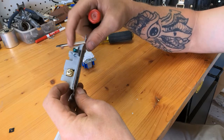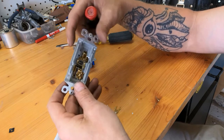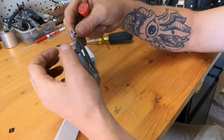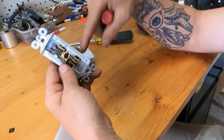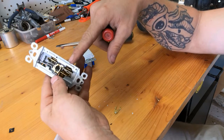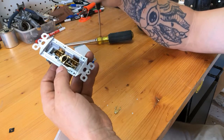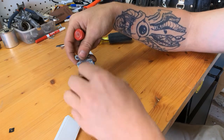Your travelers are hooked up here in between each of these. And then the ground screw - you can't forget that - the ground screw is just a piece of metal that's touching this whole yoke. So you're supposed to ground every one of these devices, just in case a hot wire flops off and touches this thing somehow. The entire device is grounded and it'll trip a breaker if that ever happens. Pretty easy - that's three-way switches.